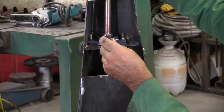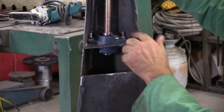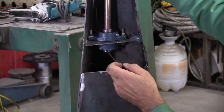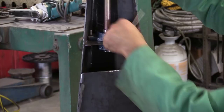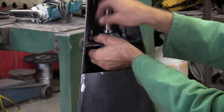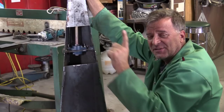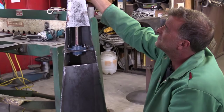So I'll loosen that back up and run it down into the lower bearing, then tighten up the two set screws on the bottom. Now, other than the fact that these two bolts are still loose and I just need to tighten those up — once you get everything tight in there, all of that side-to-side movement in one bearing gets canceled out with two bearings, and now your piece will stand straight up and spin okay rather than having a big wobble in it.